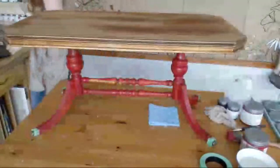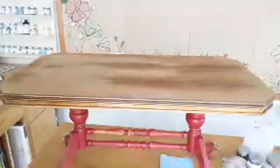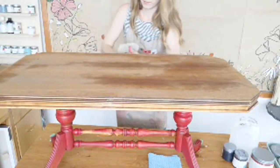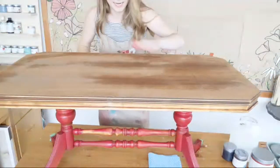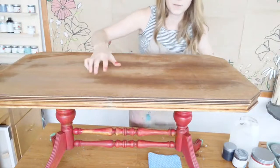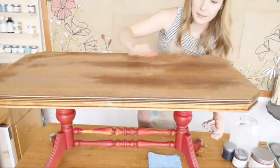I'm going to prop it up so you can see the top. Those patches are just water, not to worry. I didn't do a bad job sanding — started with 80-grit on the orbital because there were quite a few thick coats on there, then went to 180 to smooth it out. You don't want to use too coarse a grit otherwise it will scratch your finish and when you paint over you might see those scratches. Always keep it clean and dust it off.